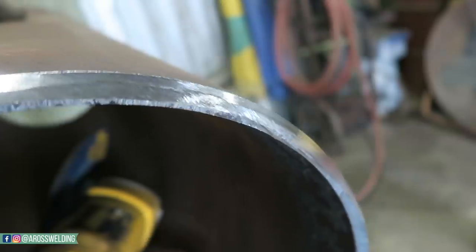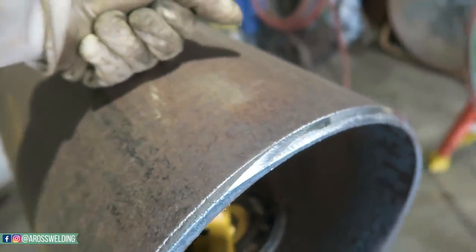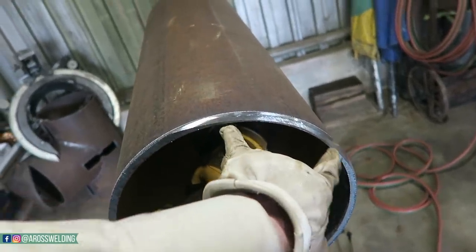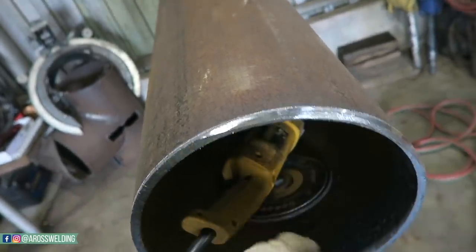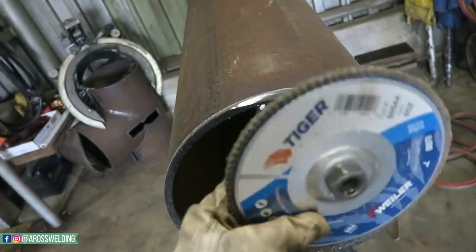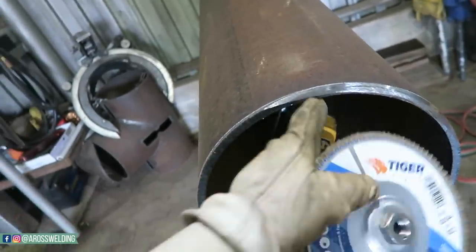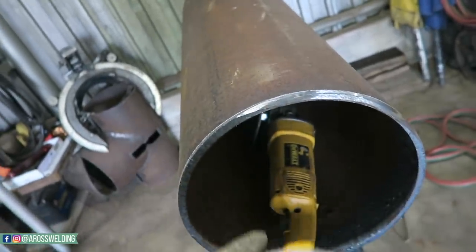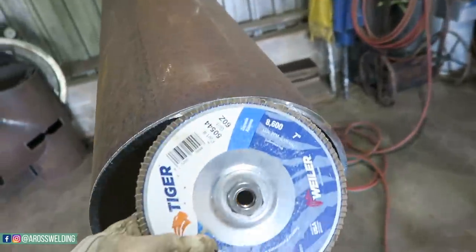You can see my landing is a little heavy right there. That section with the one-eighth grinding disc — not even a quarter — on 12-inch 375 wall took me roughly four minutes. When you run the disc like this you keep steadily changing your angle, which is one reason I prefer using the face of the disc. It looks cleaner too. Four minutes per quarter means roughly 30 minutes total to bevel this pipe by hand with a grinding disc.